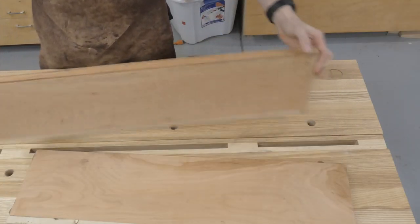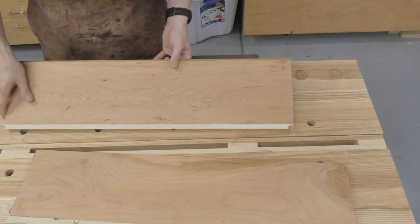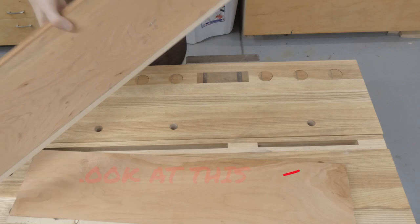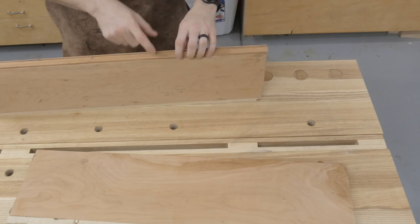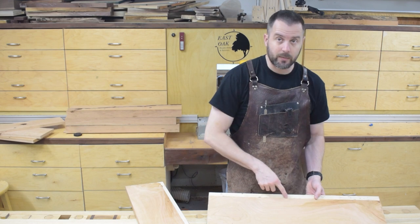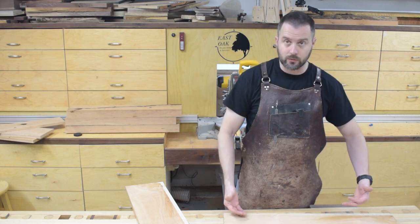However, this one, when I veneered on the second piece of veneer, when I put it in the bag, it was kind of over on the side of the bag, and I guess the bag pushed it that way, and this piece of veneer actually is sitting forward of the hardwood strip that was put on there. I'm not gonna have enough when I clean this up on the back end. I think I'm gonna have some exposed plywood. This will just be the inside face where it'll never be seen. It'll be inside a drawer box.